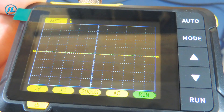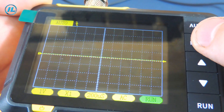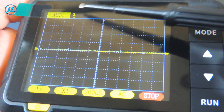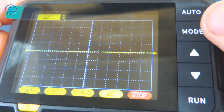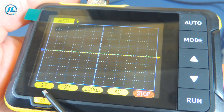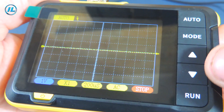The following information is displayed on the oscilloscope screen. At the top is the trigger mode — auto mode is currently selected, and you can use this button to switch between auto, normal, and single modes. The next icon displays the waveform along the decline or along the front, switched by long pressing the mode button. At the bottom of the screen there are 5 indicators. The first is the vertical sweep, that is voltage per division. To change this value, use the joystick to select the appropriate item and use the up and down buttons to change the value.